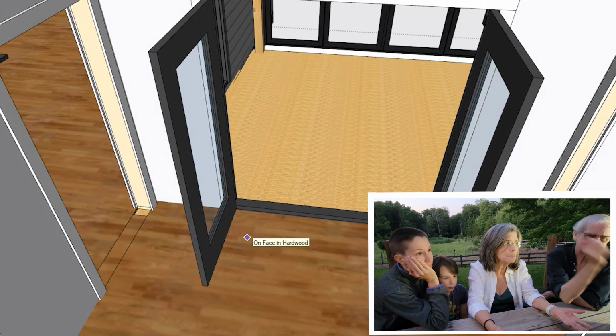So thank you, Toby. Next, we have to waterproof the foundation walls, which includes putting on the tar and putting gravel down with the drain pipe, and the county wants to see that before we do backfill. So they'll do a backfill inspection to see those things. We'll be working on that next, on the exterior of the foundation walls. And we should also have the septic system starting very soon.